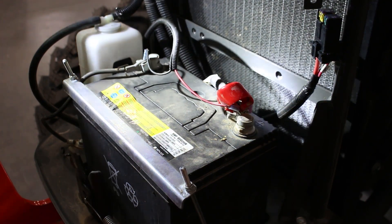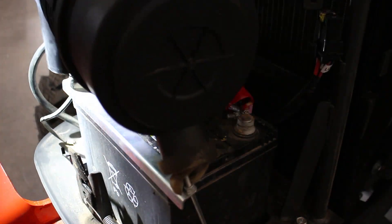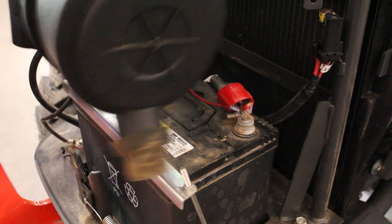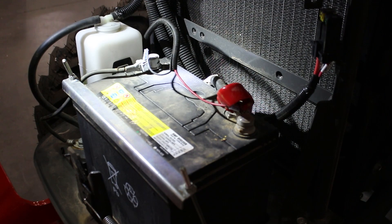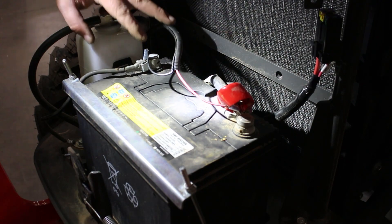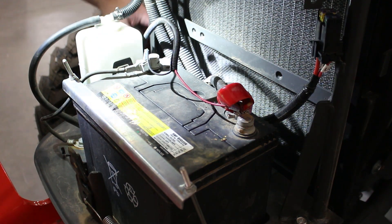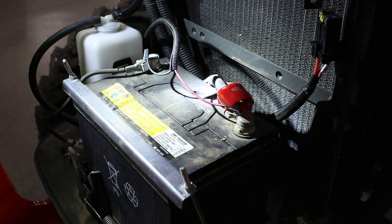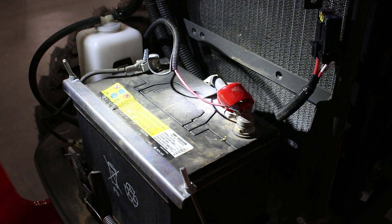You can see we've connected the wiring to the battery. I found that removing the two screws for the air filter and moving it out of the way — propping it up towards the top of the radiator — gives you a lot more room when doing this wiring; I would certainly recommend that. As for routing, I came out, down, and around, back behind a bar, and up through the engine compartment all the way to the front. I ran the wiring through the rubber boot on the joystick for the loader valve.